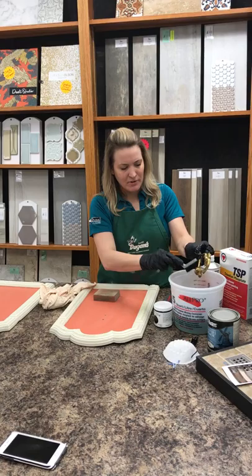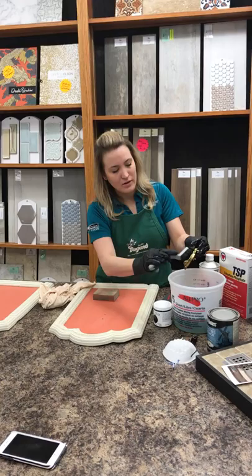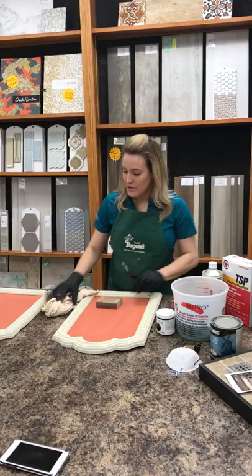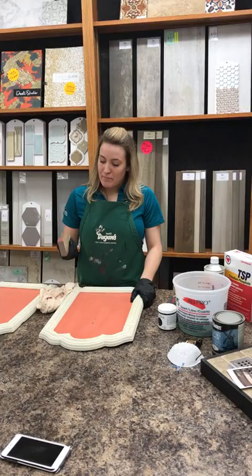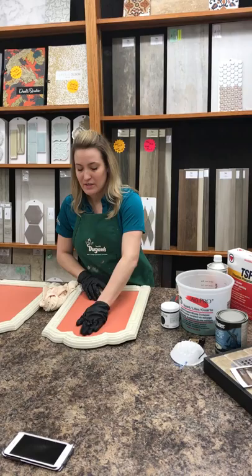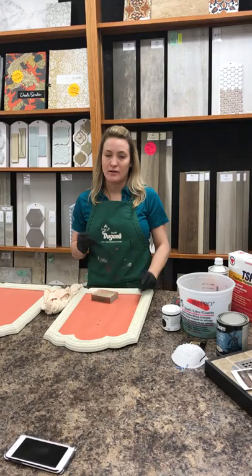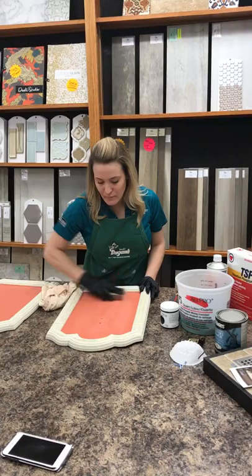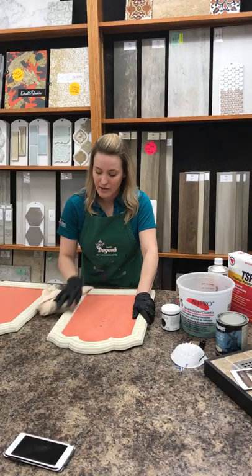These actually cleaned up really nicely — they really brightened up and you can see some of the discoloration is actually coming off with the TSP too. So you can go back with the same handles if you purchase a piece of furniture that is an antique. I've got a medium and light sanding block that I've taken just to help knock down some of the paint lines that are existing. You don't necessarily have to sand this product before coating but it's not a bad idea if there are some uneven surfaces or it's a really shiny surface.